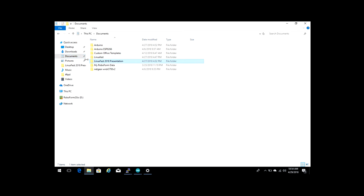Does the IDE compile it as well? The IDE can compile and then send it to the board. You can just compile it, or compile it and make a hex or bin file, then give it to somebody else and they can upload it to their device using firmware flashing software. For development, usually people use the IDE — you can just compile or compile and upload.